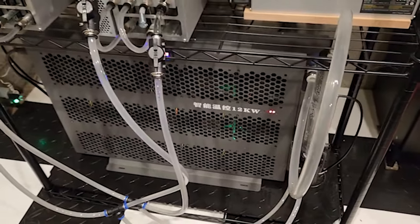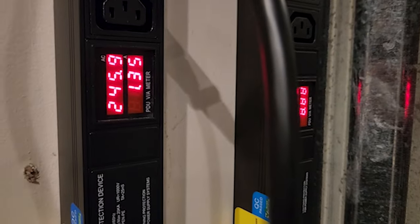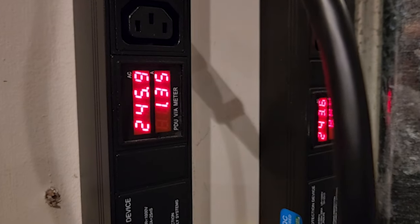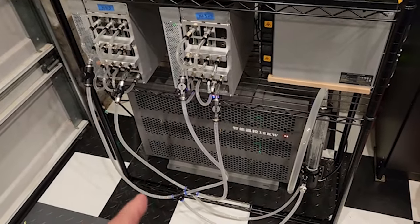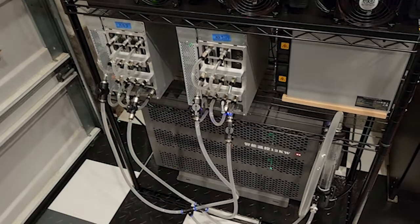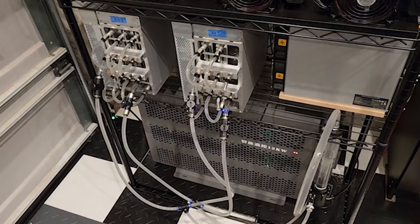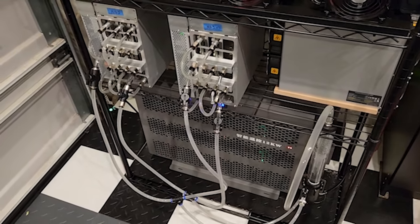As far as power consumption for the radiator: it is rated at full speed to pull 420 watts according to their website. We are currently pulling at 245.9 volts and 1.35 amps, which equates to about 330 watts right now running two miners — so about two-thirds of its max wattage, running two miners at roughly two-thirds capacity. You can factor that into your power consumption calculations.